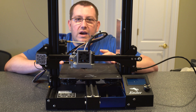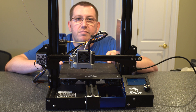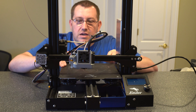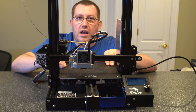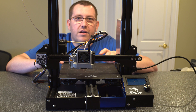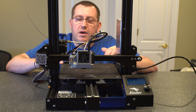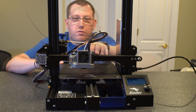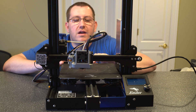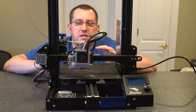So let's start with what I check after every two prints — really it's going to be two things. First, I make sure that my build plate is still somewhat level and that it's not wobbly. If you go like this and you're getting a lot of play, you want to make sure that you adjust that. I did a video covering how to tighten up the bolts; I'll link to it in the description below. That's the basic maintenance after every couple prints — just making sure your bed is level and stable.